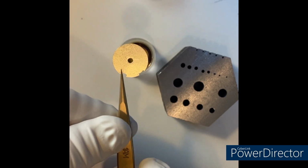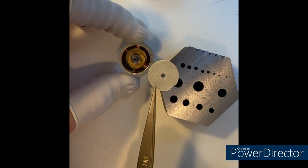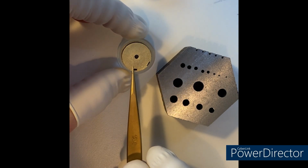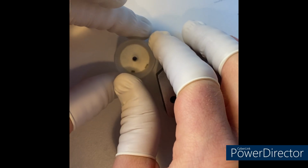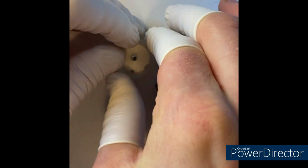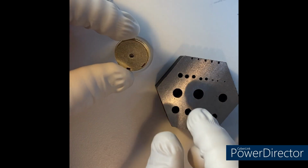And then we can put the lid on again, using this barrel closing tool to do that properly. It actually pushes on the barrel lid evenly from all sides, and then it's secured. And then it's ready to put back into the movement.